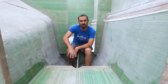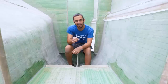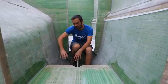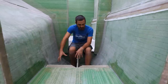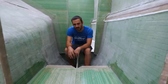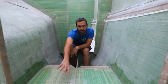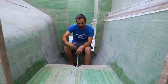One of the other questions we got is why not fill these with closed cell foam? Well, the whole premise behind foam is the fact it has little air bubbles in it, and the air is what's actually keeping it buoyant. So by having these individual cells that are roughly two feet long, two and a half feet long - we are making these individual little foam-like pieces basically, and that's what's keeping us buoyant here. It would be redundant, on top of the redundancy we already have, to use closed cell foam, because if we were to puncture this part of the hull, it's not going to spill over into the next area. We have this double floor setup and these webs, so we really don't need it.